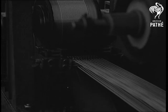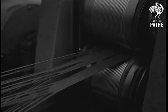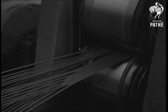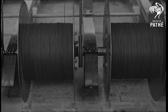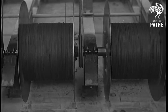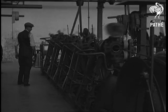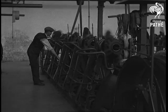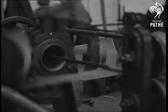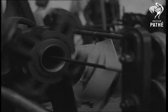According to the thickness of rubber required, this process can be repeated. As a general rule, three such layers are applied. This process is applicable to single wires and conductors which are not large in diameter. When larger strands are to be covered, the rubber compound in strips of the required thickness and width is lapped on the conductor. In this big machine, five such layers are being applied at the same time.